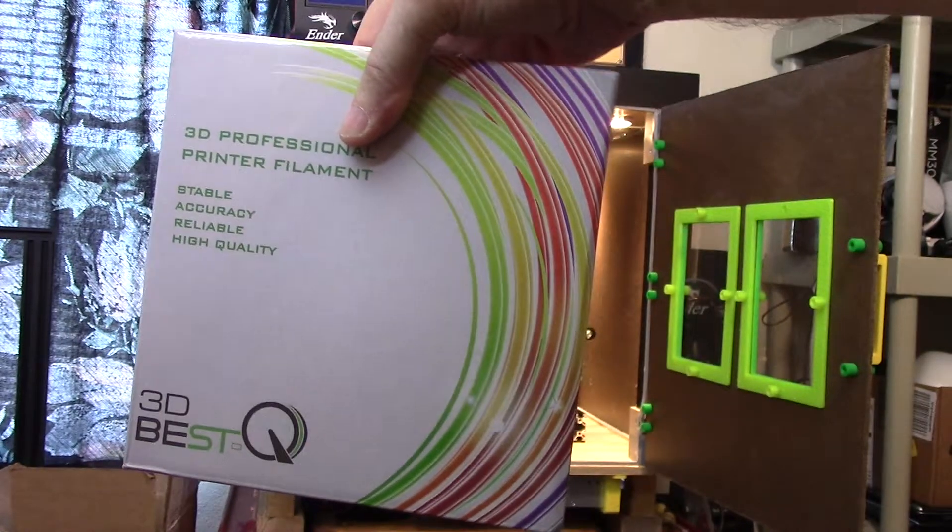That's my quick review and first test of the 3D Best ASA White Outdoor Filament. I'm going to start a 6 to 8 month UV test with the ASA and probably two to four other filament types, plus some different UV protectors. As for this initial test, I like it — I think if I tweak settings a bit more it would print as good as ABS, though right now the quality is more like PETG in terms of smoothness and blobbyness, and I don't think it's quite as sturdy as ABS yet. We'll discover more with further testing. If you've enjoyed this video, please like and subscribe. Bye for now.